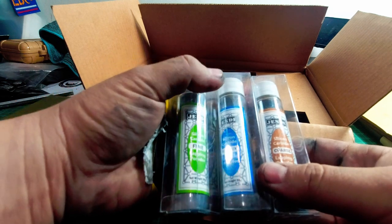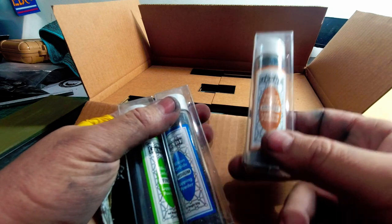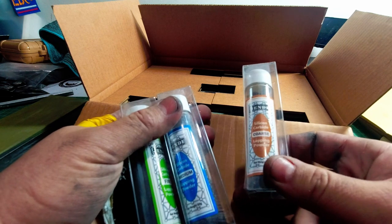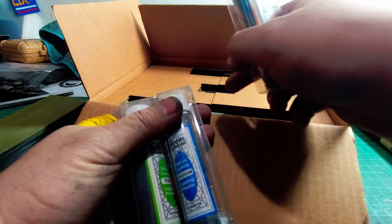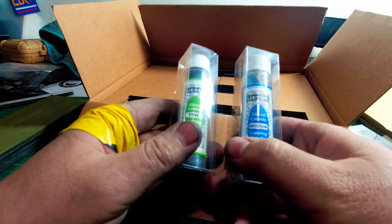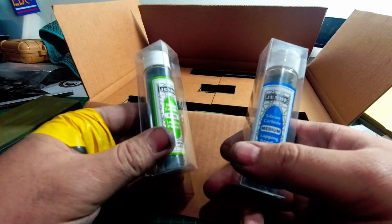All right. So from what I hear, coarse is extremely coarse. If your stone is in horrible condition, really bad condition, then you use this. Or if you're dealing with diamond resin stones, then you use this. Because not only does this eat the stone really quick, it also tends to eat the glass really quick too. So if you can, avoid using that. And for something that's not too bad, but you do need to lap it, I think this probably falls in that category.